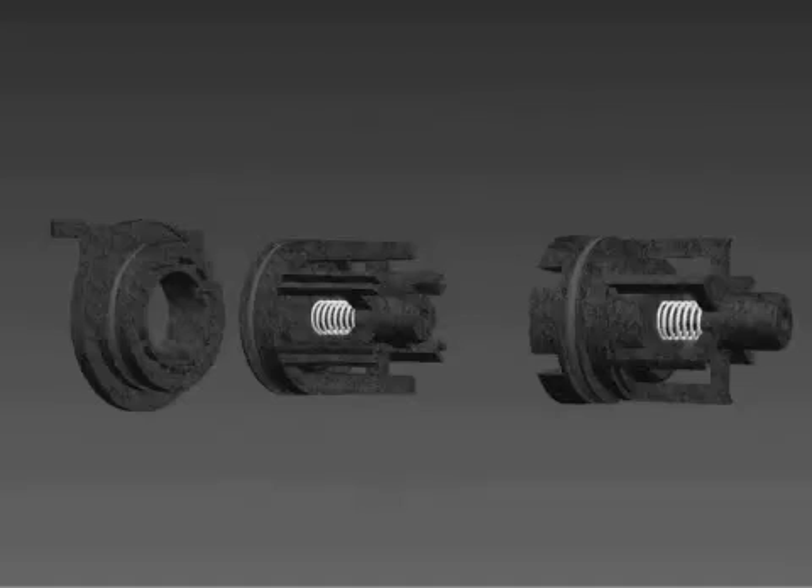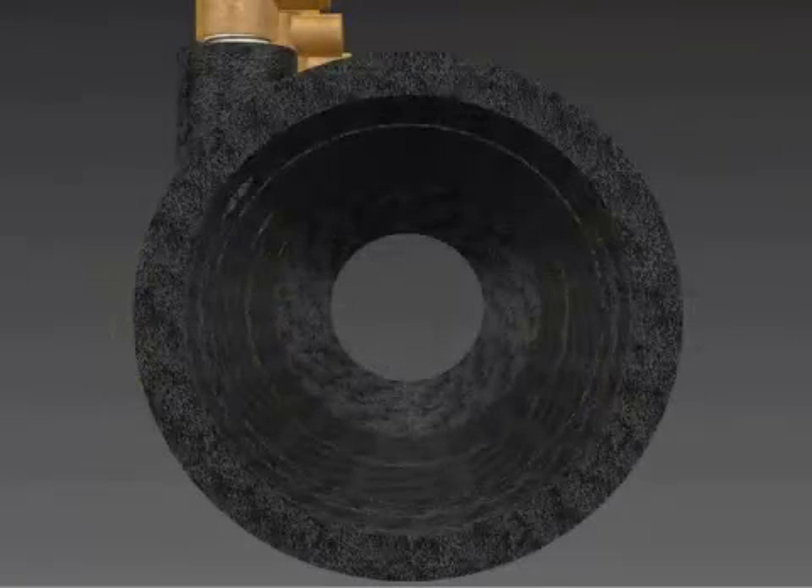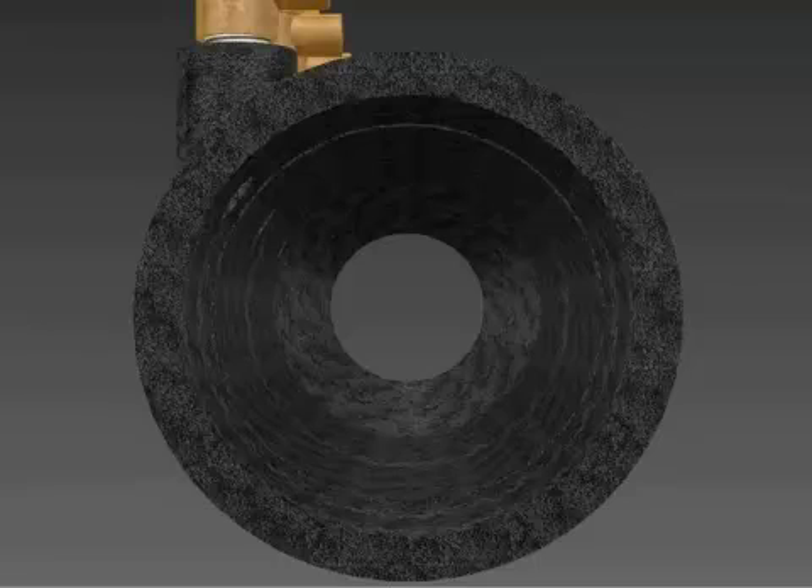Place your new O-rings on the seats of each check assembly and the sleeve if needed, and lubricate the O-rings. You will wipe clean and inspect the inside of the housing. Place the sleeve on a flat surface with the bolt tab hanging off the edge.